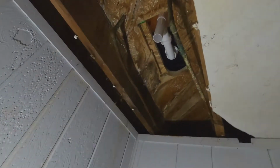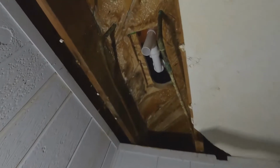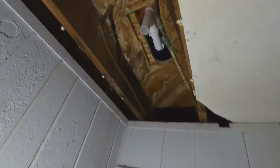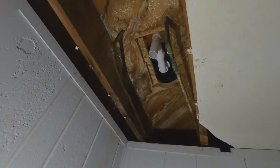Okay, so you'll see I've got my tub drain just loosely fastened in there with the tub. It's not really tight and secure, so I can still move it as I need to, and I haven't sealed up around the surface of the tub underneath the drain, so I still need to do all that. But I just put it in there so I have a rough idea of where to run this drop and tie it back in to the copper line that I've cut here.